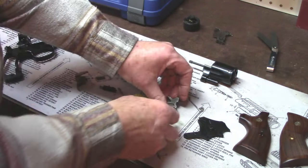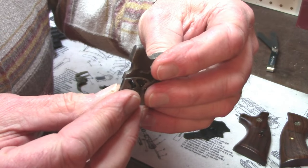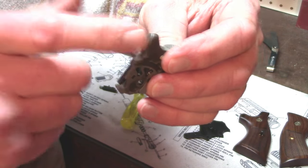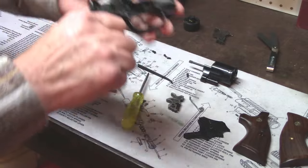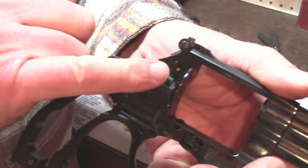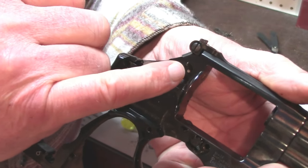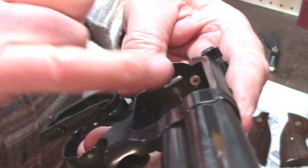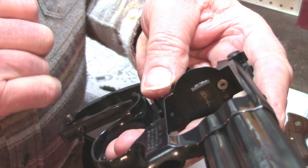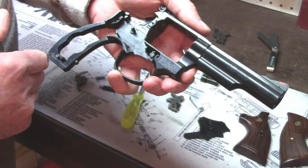So another great innovative change — they've eliminated that pesky hammer nose and now have a highly intelligent hammer that strikes a spring-loaded firing pin. Much better. Here's the close-up of the firing pin retaining pin. That has to be drilled at the factory — it just sits in there by gravity. Here's the firing pin and the firing pin bushing that holds the assembly together. Inside that there is a coil spring. So it's more costly — not cheaper, more costly.